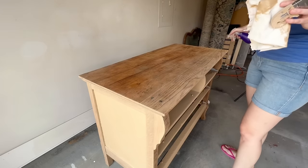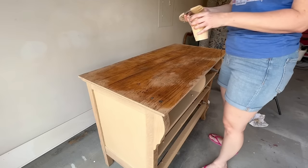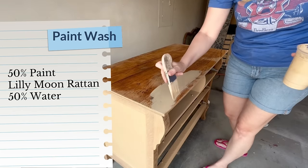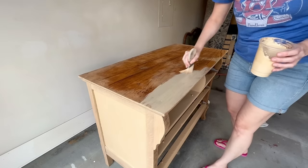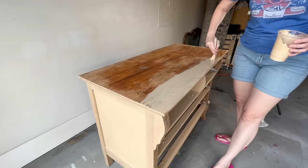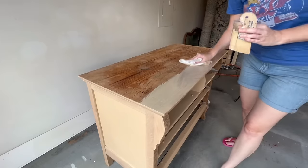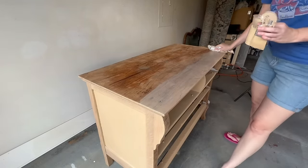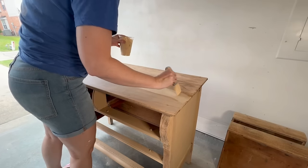Now that all the blue paint has been covered up, I'm going to take 50% Lilymoon Rattan paint and 50% water and mix it up into a paint wash for my solid wood surfaces. This is just going to help hide any imperfections left over on the wood but still show a lot of that beautiful wood grain. I've wet the top of the dresser with my spray bottle because it'll help give my paint wash a little more open time before it dries out. I like to do everything in small sections when I do a paint wash — once I get a small section done I'll wipe it back with a dry rag and just keep moving.